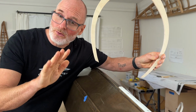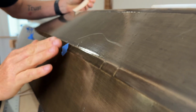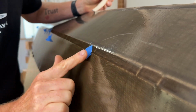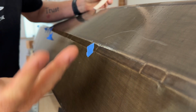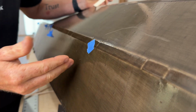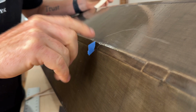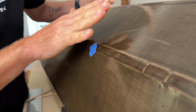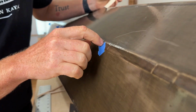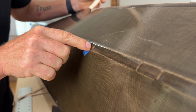However, you can see right away we've got a problem here, because if you come in real close and look at this chine right here, this isn't just one hard edge like you might see in a plywood boat. It's actually two edges with a little facet between them. And if you were just doing something like taking a historical survey, something that really wasn't performance oriented, I would just recommend taking your height and your width right from the middle of the chine, and that's going to be totally fine. But in the case of what I'm doing right here, where I want the survey to be able to reproduce this boat exactly in potentially different mediums so we can have exactly the same performance, I've got to find a way to capture this information.